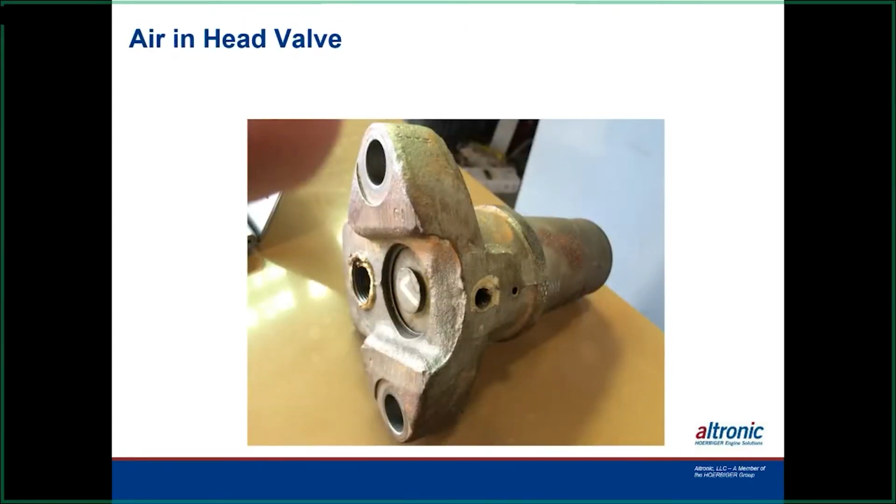And another valve from Cooper. You've got a little weep hole right here that will bleed off the air from the back side of that. But in some cases, air just pours out of that because the valve itself is so worn out that it doesn't operate properly. So again, real important: you've got to make sure these valves are in very good condition to make the system work.